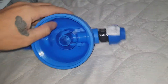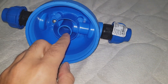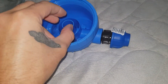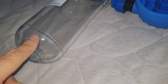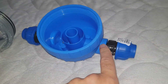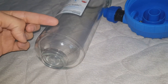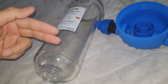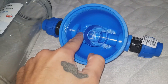Over here I'm going to need another piece of pipe — you can use a 20mm PVC plastic pipe. I'm going to put it here and it's going to go longer until it reaches the bottom part of the filter casing. This is the inlet: the water is going to flow down this pipe and after that it's going to flow up and through the media — the activated carbon or bio pellets — and reach the top of the filter housing and exit.